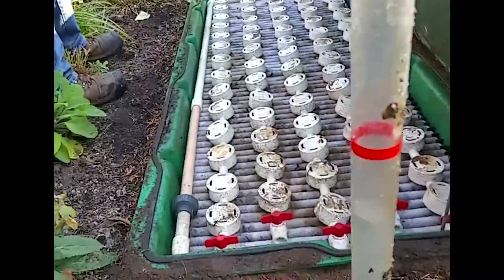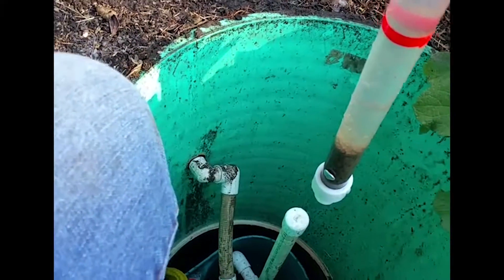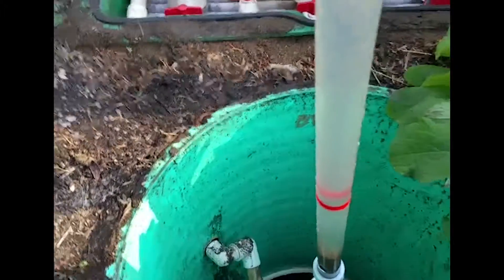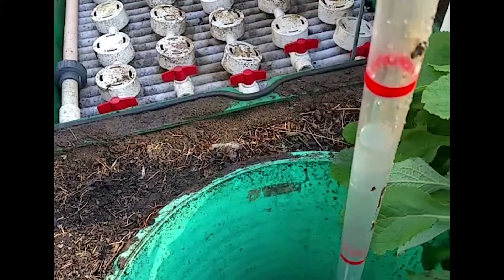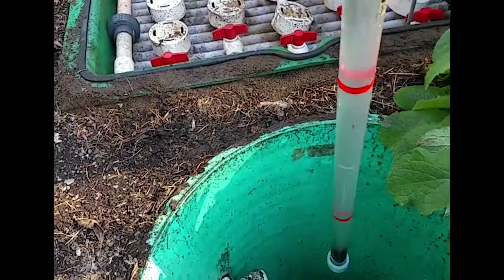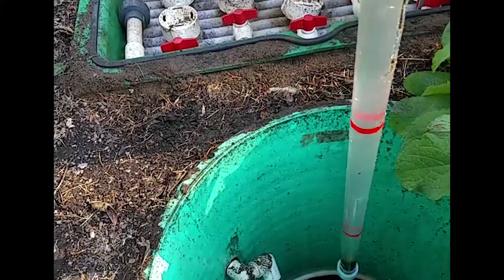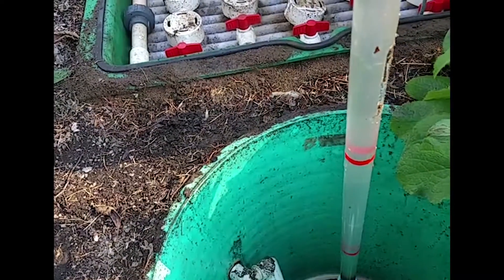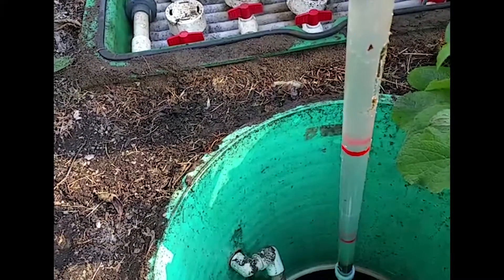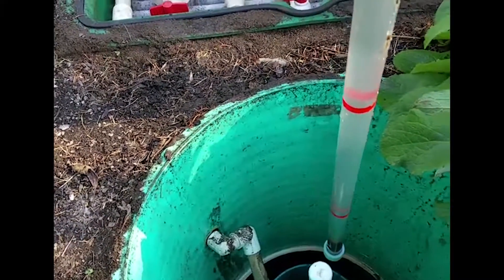On the recirc side, the water's a lot clearer. We do have what may look to be like four inches in the bottom, which Cass will register on the form, but otherwise it looks pretty good. This tank is a 1,500-gallon tank. It's baffled — this is the 500-gallon side. It's got a flow-through baffle in the center of the liquid zone, so just the clear liquid comes through to this side, and then it pumps up over the media.